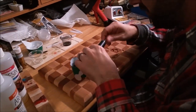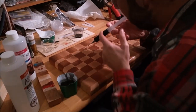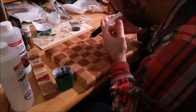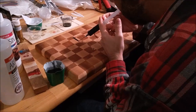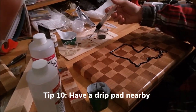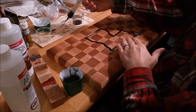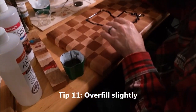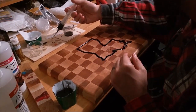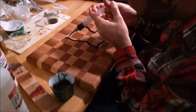Put the needle back on and now with a precision applicator, start loading the epoxy into the CNC channel. I've got two colors - the outside is going to be black - so I go once around slowly. Keep a pad nearby to dab any excess. Then go around again. You have to fill it slightly over level because as it reacts it will expand then contract and suck in. You need it above the surface level so you can sand it down, which means filling with a slight meniscus on top.